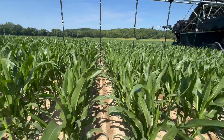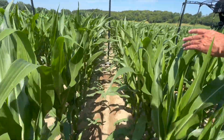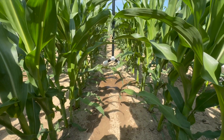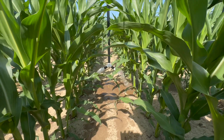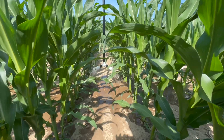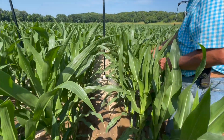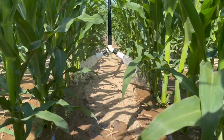The biggest thing for this, if you haven't seen it — you're just putting the water in the sweet spot. You're not wasting water. Because he's got pivots and other operations too, the efficiency of this is definitely worth noting. The goal was on the whiteboard: could we raise more corn with 40% less water? That's a pretty broad reach to say 40% less should raise more. The exciting thing is last year in our trials, 30% less water raised 18 bushels more.